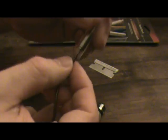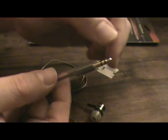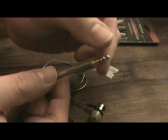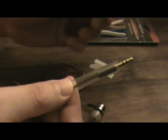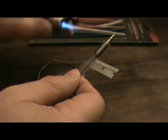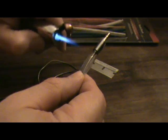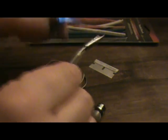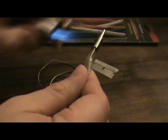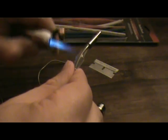We've got a little piece of plastic tape starting about the middle of the rigid section and our jack is ready to go. Now we take the tubing and slip it right over — it's already pretty snug where the plastic is. I'm going to have it projecting over the edge a little bit, maybe about an eighth of an inch, a couple of millimeters. Then I'm going to take the lighter and very, very gently, from a few inches away, begin to apply heat — and you'll see that almost immediately it shrinks. You want to be careful not to heat the wire too much because you don't want to burn through it. The diameter shrinks, as you can clearly see, but the length does not shrink very much. Go all the way around it and just gently stroke it with that flame from a distance. Matches will do a very good job on this as well, or a regular lighter, but I kind of like this cigar torch because it's a little bit easier to control accurately.